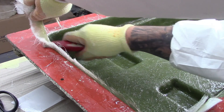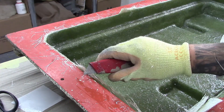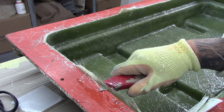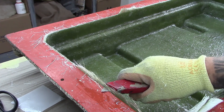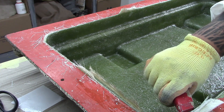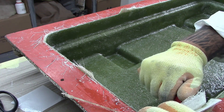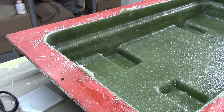One tip: if you are lucky enough to catch your laminate when it is semi-cured, trim the excess fibreglass off with a sharp trimming knife. This could reduce finishing time and effort later. In some cases, you may only need to sand the edges after finishing a part using this method. Ensure to remember to leave lifting tabs to make demoulding of the part easy.